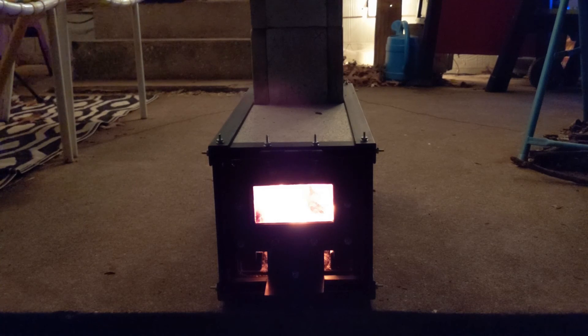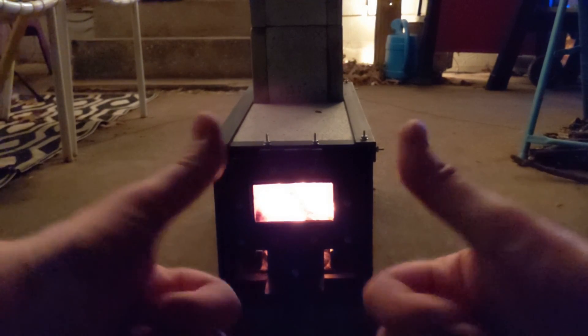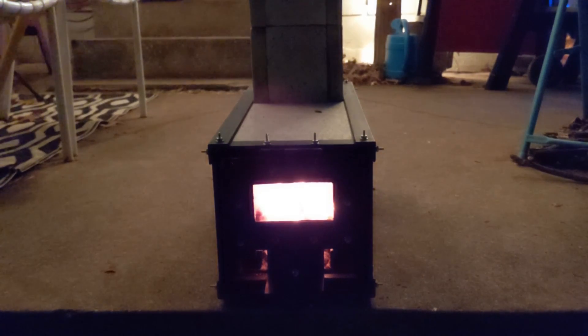Closing the door and seeing all those blue flames was insane, even if I don't measure a huge difference at the top — maybe 50°C or 100°F. It just looks awesome. But you get most of the way there with just the proper-size heat riser and a grate that lets ashes fall through — those make the biggest difference. If you've built a rocket stove or want to and have ideas on how I can make it better, leave a comment. Don't forget to like if you enjoy this kind of content, and thanks for watching!